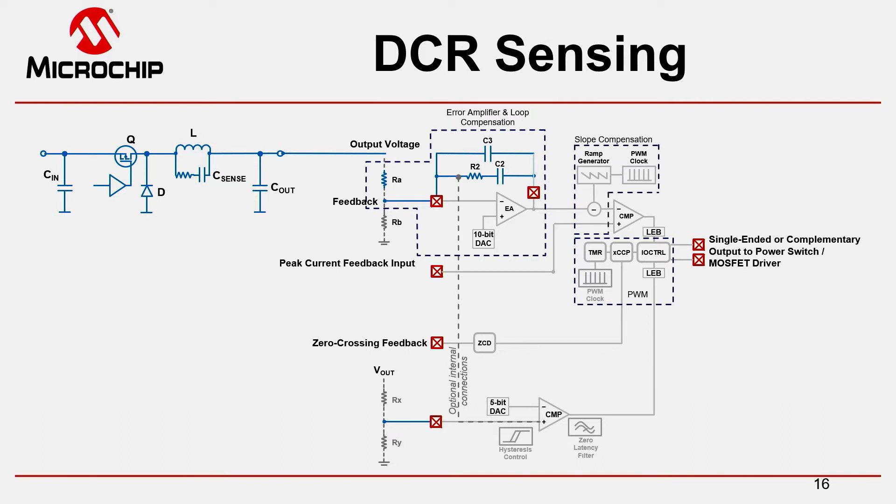This emulated feedback signal is at the high side, meaning it's at the high line, which makes it a little challenging to interface this capacitor voltage from the controller side. What we need is a differential amplifier. We wire this capacitor onto two device pins and internally connect an op-amp to these two pins. The amplification factor is set by external resistors, which helps us scale the feedback signal to achieve the current gain needed for a proper inner peak current mode modulator.